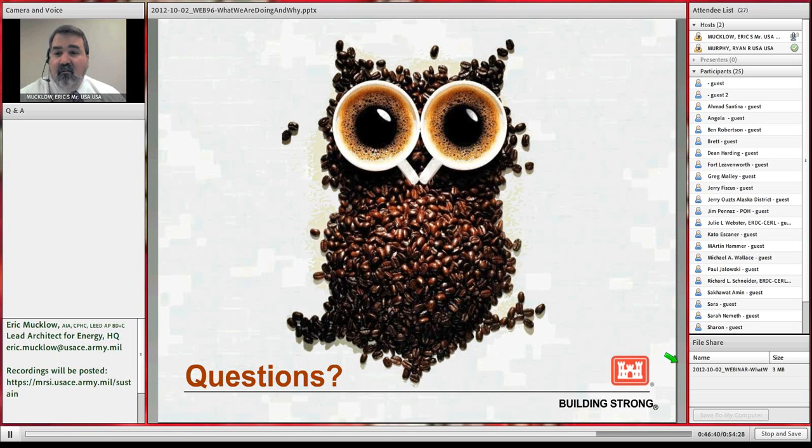How about using VE to do life cycle cost analysis? Value engineering. It's kind of a different animal than life cycle cost analysis. Value engineering tends to focus on getting the same performance in a more efficient way in terms of schedule or cost. Usually they tend to focus on the upfront cost. That's certainly viable to do things that look at value engineering from a life cycle cost or a total cost of ownership. I think that you'll see more guidance coming along those lines in the future toward the value engineering efforts, specifically that they should not delete things that are put in there for energy efficiency on the basis of first cost. We've seen some decisions made in the past where things were cut based on lowering the first cost at the expense of the operational cost. And we want to try to avoid doing that kind of thing because that will never meet our goals if we do that.